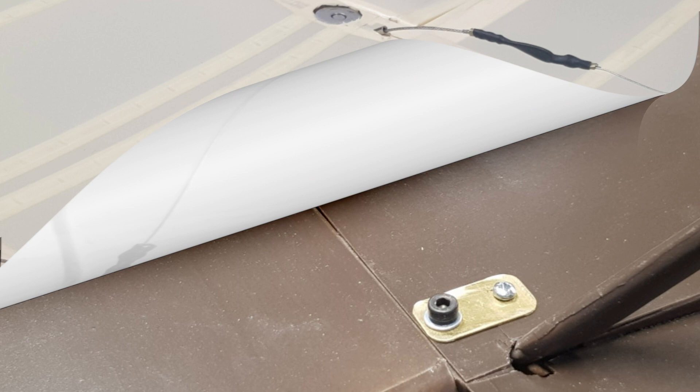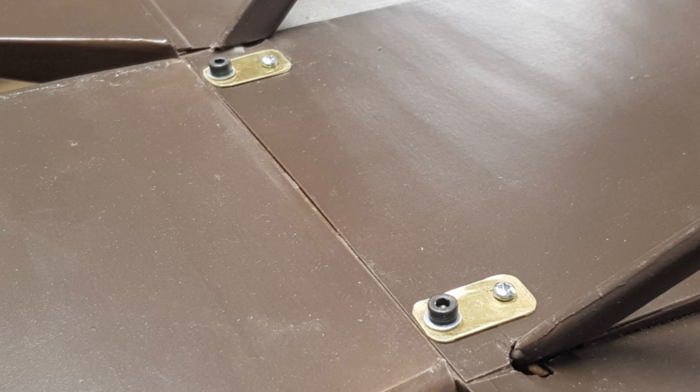Day 95. The coupling for the wing rigging is not very nice, so I decided to slide some heat-shrink tubing over it and then blast it with a hot air gun — this looks a lot nicer. I do not completely trust the fastenings of the undercarriage, so I decided to make up some brass plates that I put under the wing fastening bolts and over the landing gear wire, and then screwed these down on the other side. This is much more reliable, especially in the back where the undercarriage was only held in place with 0.6mm plywood.